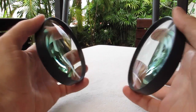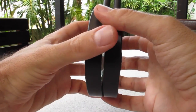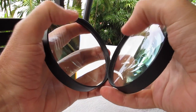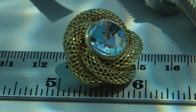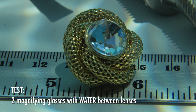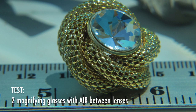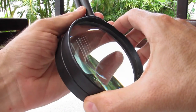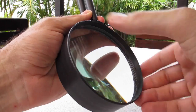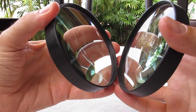With this information at hand, I decided I wanted to build a macro lens that was airtight and waterproof, to preserve the space in between the lenses as air space, and find a way to seal off the area around it. This assumption proved correct — my frame width went from about two and a half inches with two lenses and water in between, to much smaller with two lenses that had air in between. But making it waterproof is not enough, because with increasing depth there is increasing pressure. The water pressure would eventually press against each lens on each side and make them collapse. For that reason, we need a spacer — something that withstands the pressure between the lenses.